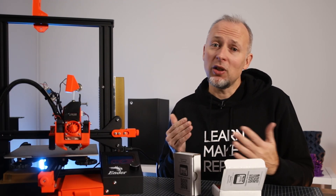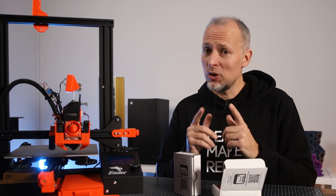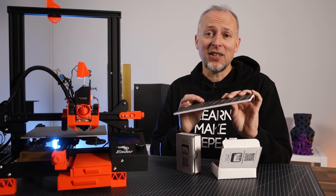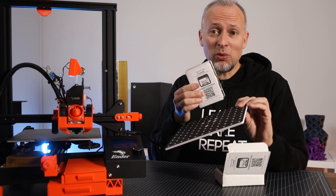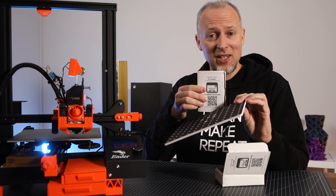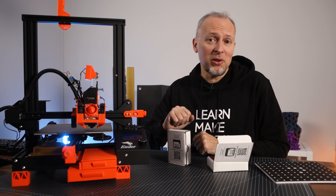It will do this to some regard, but it's probably working differently from what you expect. If this is your tilted bed — and it is of course very extreme — you might think that auto bed leveling will print something that is supposed to be square like this. But it's actually trying to print it vertical, so the result might more look like the tilted tower of Pisa. So that's why we're going to level this bed now using the E-Leveler tool.